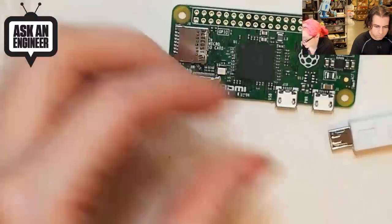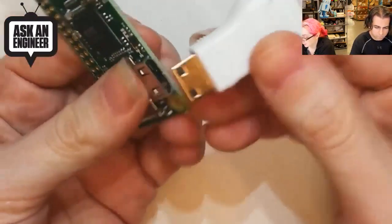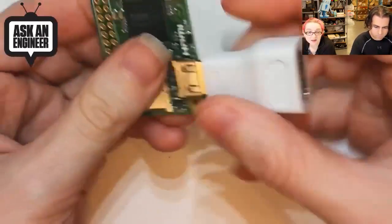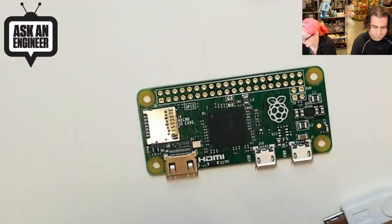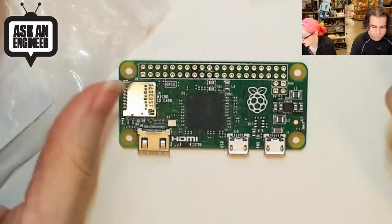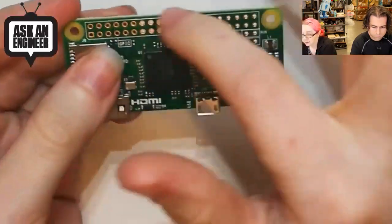To make the HDMI port small enough so they could make this board gumstick size, the HDMI plug is also mini. So you can get a mini HDMI cable, but we also have handy little adapters that are standard HDMI to mini HDMI. It looks like a standard HDMI but it's actually much thinner and smaller. If you don't need HDMI, you don't plug it in — but if you do, that's how you get video and audio out, including digital audio. There's also NTSC/PAL TV output available — you have to solder onto those TV-out pads. It's a single-sided board, which is kind of neat.